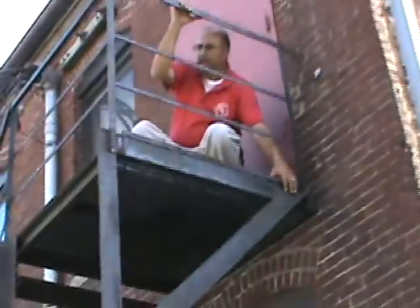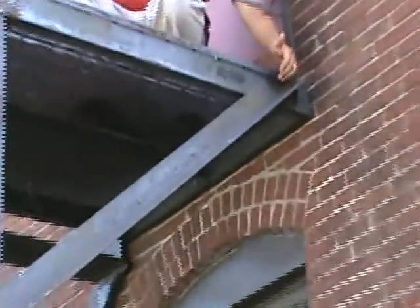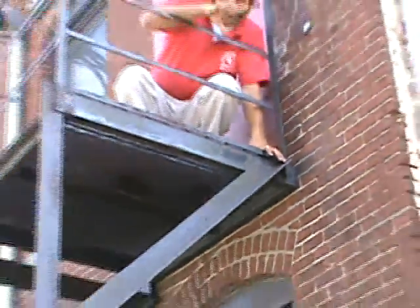All this fire escape was kind of put together. So all these brackets and all these connectors here. See, the only way I can guarantee this weld, if it's not a rust build, is, and you can't weld on fire escapes because of the EPA requirements. As soon as I put in 2 structural bolts here, 2 structural bolts there, then I seal this up with silicone. I don't have to verify the welding.